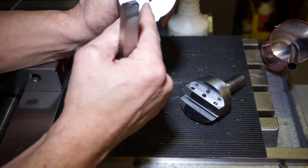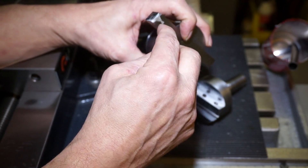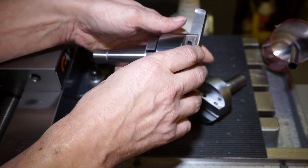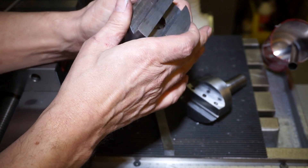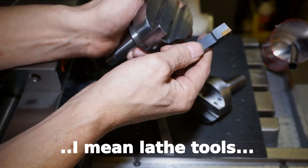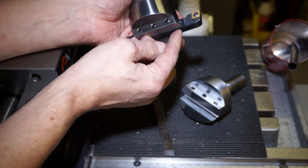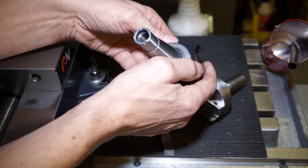Tony talked about the center line in relation to the cutting edge — how you want the cutting edge to be on the center line or maybe slightly above for an ordinary right or clockwise turning machine. He also talked about how you could use milling tool holders for a fly cutter, but you would have to use a left hand tool. You couldn't use a right hand tool, because the tool bit would be on the upside when mounted on the center line, or you would be way off center line and you'd have to rotate counterclockwise.